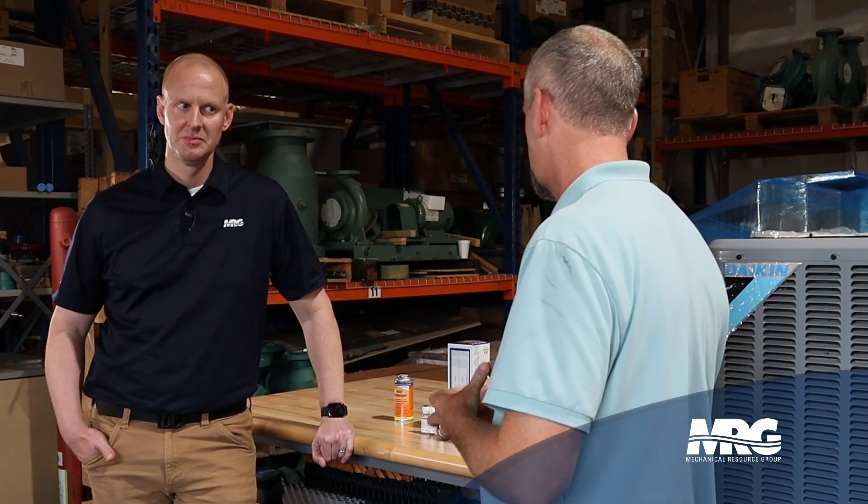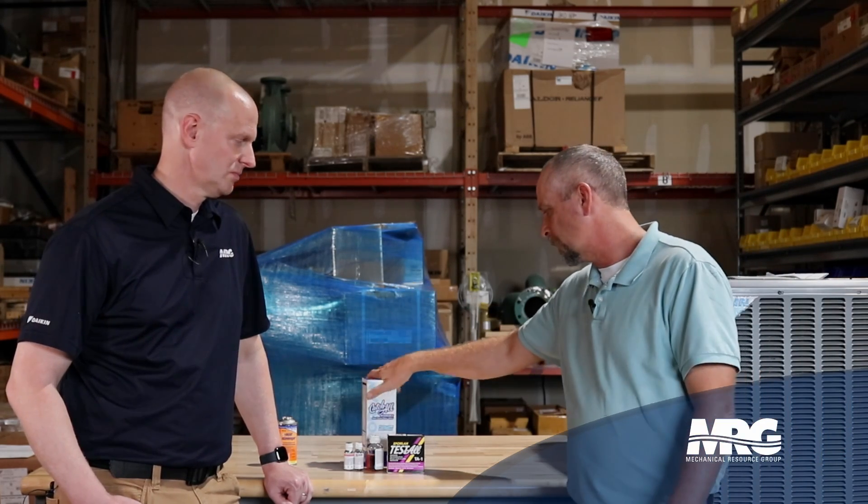If you weren't sure for some reason — maybe it was an off-brand and it didn't say it right away — HH at the end tells you it's a burnout dryer. You could also put a suction line dryer in as well. The thing you'll run into on these smaller systems is you're typically going to need to return and remove that suction dryer after some runtime, because it can get a restriction across it and cause a premature compressor failure. You need to be aware of the return trips involved — there's going to be at least four hours of extra work: isolating your condenser, unsweating it, pulling another vacuum. The customer will need to be made aware. We typically don't do it on the little ones — we'll use the burnout liquid line dryer.